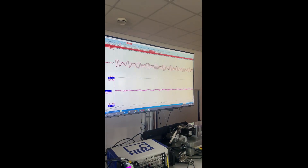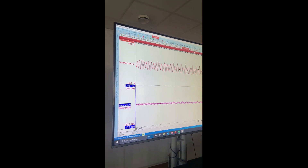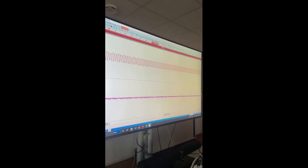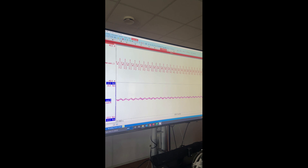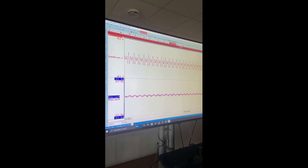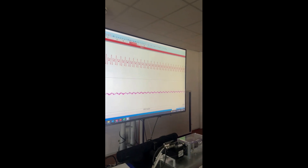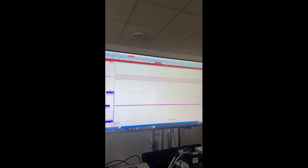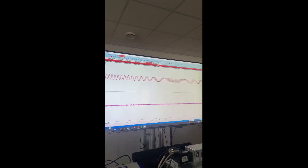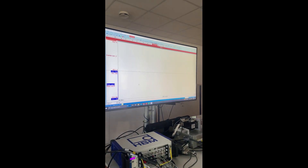In the rig we've intentionally made it worse. But in real life you could do the opposite and make the situation better. So we've got our really smooth current. The intention is so a customer can actually see how they determine torque ripple on their system — using our tools. You can understand how the controller controlling the currents directly affects the torque. The torque's got a frequency to it. The current's got a frequency. If I turn that down, the current is really sinusoidal and the torque is pretty smooth. We can look at the data because we record all that data.